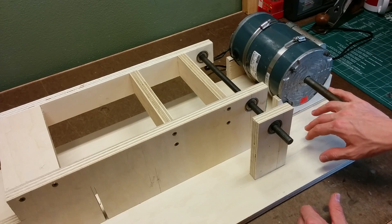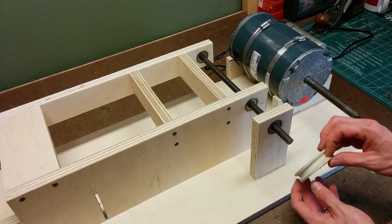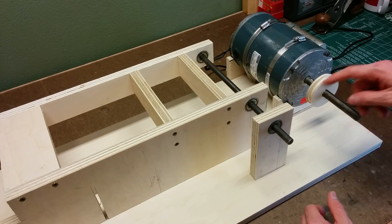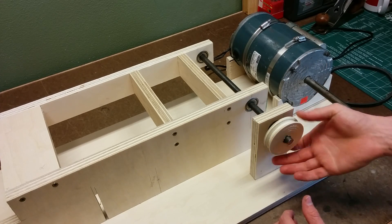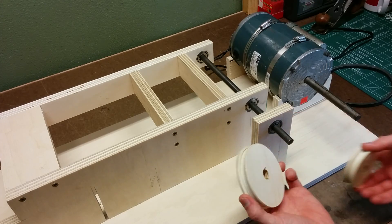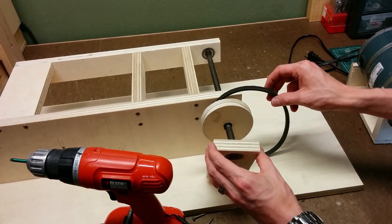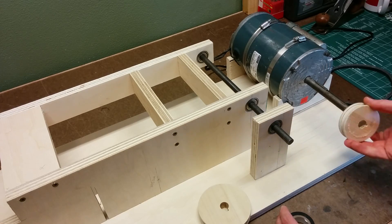The next thing I need is two pulleys, one on each of these shafts. I've already experimented by turning some out of three-quarter inch plywood and I need to make another one now for the shaft on the sander. The problem is this shaft is five-eighths of an inch and this shaft is only half an inch, so turning another one on the motor is going to be too sloppy. So I'll use one of my original test pulleys, tape up the shaft to make it fit tight, then cut out a third circle and turn that one right on the shaft to match the smaller pulley going on the motor.